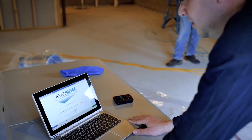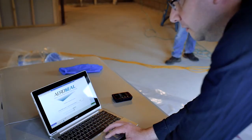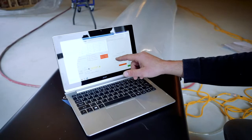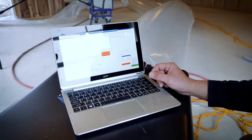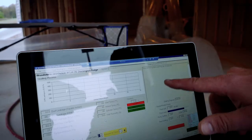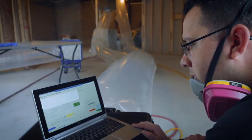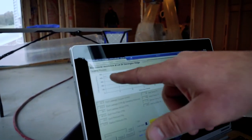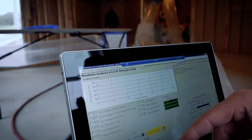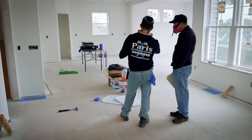This is the computer that is going to control the HomeSeal machine. I'm currently setting up the program and creating a new customer for the house we're about to do. You're going to see the wand go green and heaters one and two go green as it warms up. We start it here — now we want to see that go down. If it stays level, that means it's not sealing properly, but we give it a little time to see how well it goes.